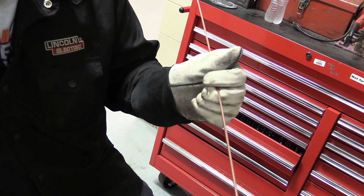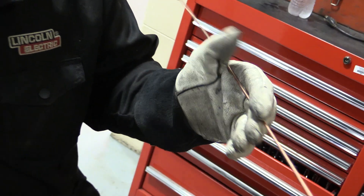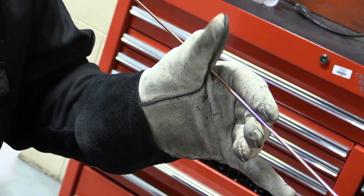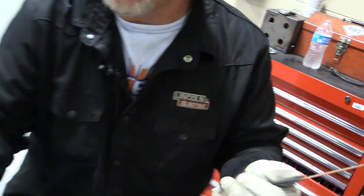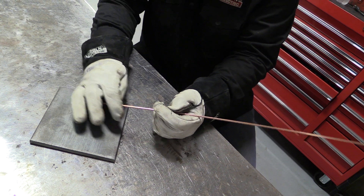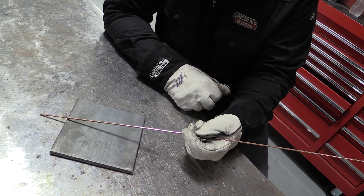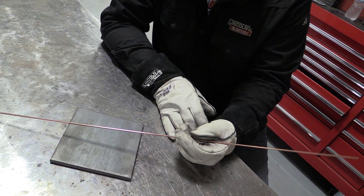The other way — we pull it, pinch it here. That's really all I'm doing, and that's the best way to start. Once you get better, you'll get your thumb down in there and start using your thumb and your fingertips more fine-tuned. But to begin with, don't even worry about that. The advantage of learning this right off the bat is when I'm welding, my hand isn't up near the weld getting burned, and it's not way back with the rod wiggling all over the place. I can set my hand right here, keep feeding that filler with good control all the way across. My hand is steady, touching the table, and I can just keep feeding.